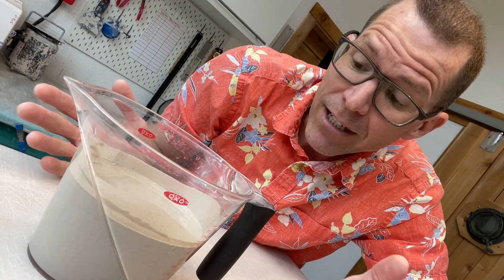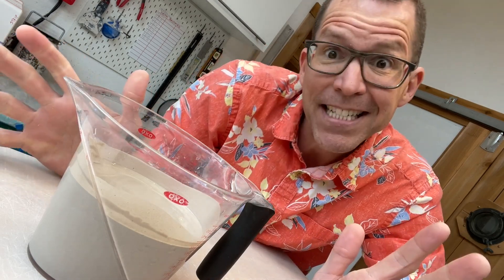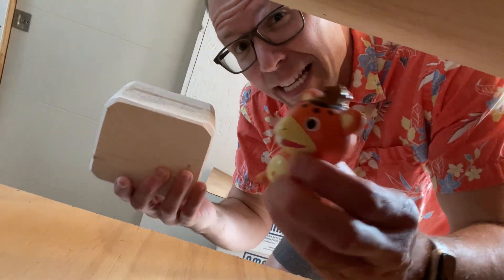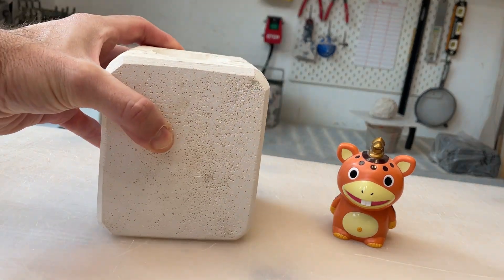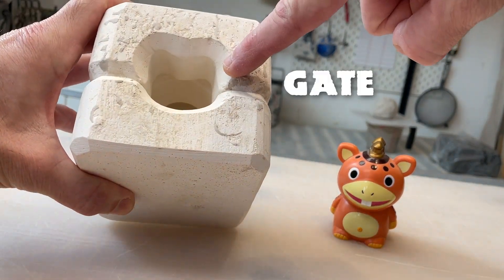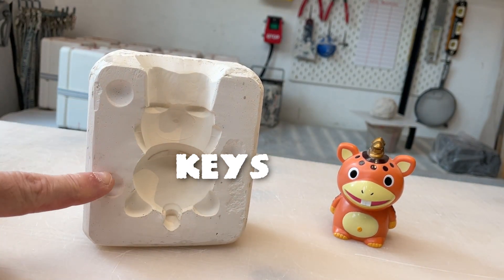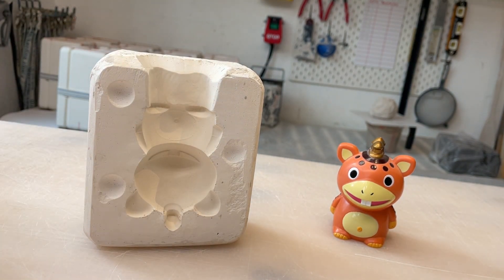Why is water content such a big deal? To answer that, we should move on to the casting part — and that means we're going to talk about molds. For today's example, I'm going to use this mold: my glaze tester mold, a little mold I made of Busca — Kaiju Busca. Molds are used to duplicate things. They'll have a gate for materials to go in, keys that help the mold halves register when you put them together, a well to hold extra material, and the negative space that becomes the casting.